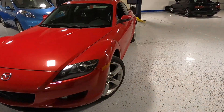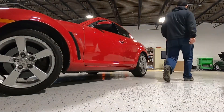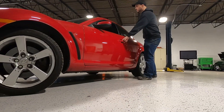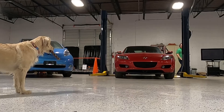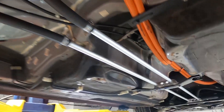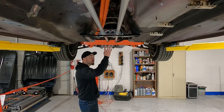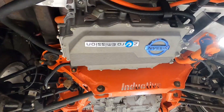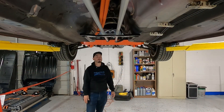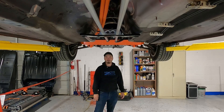The trunk is basically the same — you still have your full amount of cargo space usable from the factory. Here we are underneath the car where we can see the electric motor in the custom subframe that we built for this build. We chose the EM61 out of a 2012 Nissan LEAF. We like this motor because it's a nice compact size, and the built-in gearbox gives us the perfect ratio to run axle shafts directly out to the rear wheels.